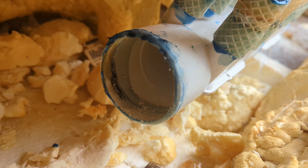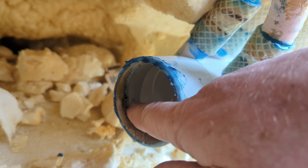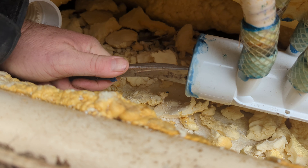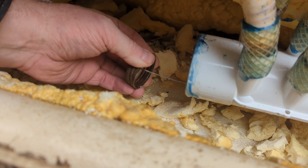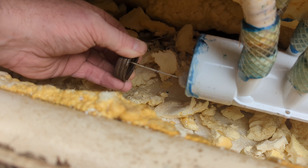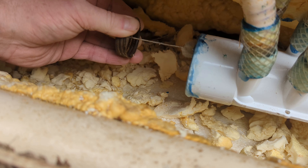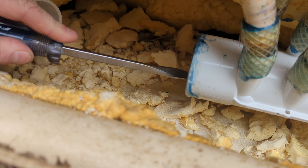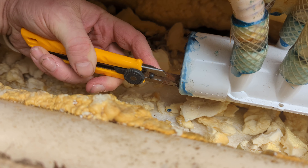There's our piece inside. It's kind of rough so we're going to have to clean it up so we can fit the pipe in a little bit further. Use a screwdriver or whatever you can. I'm just going to use a little bit of primer — it just softens everything up. You want to prep it before you put that pipe in because this next part is going to be a pain. Use whatever tools you have to kind of shave up the inside of it.